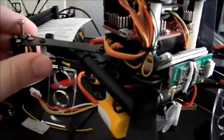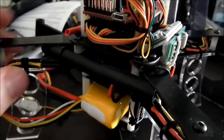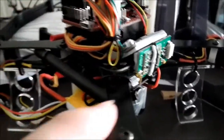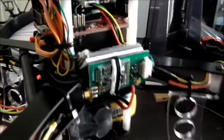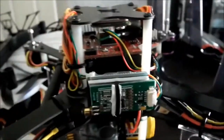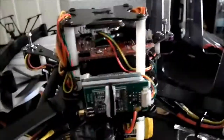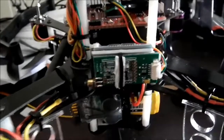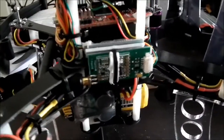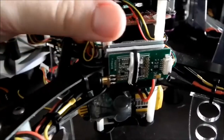Because it's such a small copter, I've had to sort of optimize the space a bit. I've got the antenna sort of stuck down the side here, which isn't ideal — it'll make it a bit directional — but I've got plenty of power to play with anyway. That's the low voltage beeper. I've also set it up so it can send the battery voltage back over serial to the computer or to my phone as well.